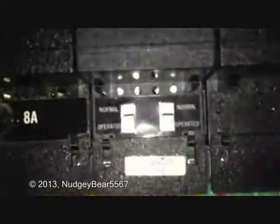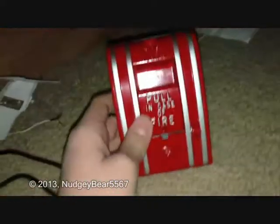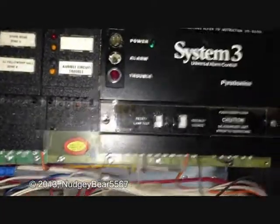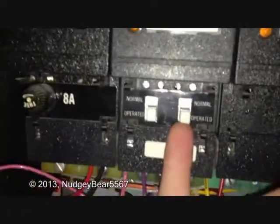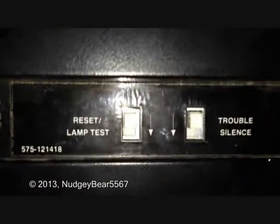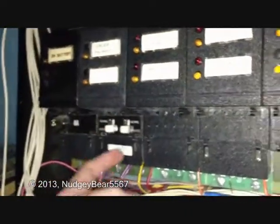Now the thing — you'd have to have the horns in the operated position. I'll just pull this thing. It got a new one — watch the video of unboxing. You'd pull the fire alarm, then the alarm signal will go to the panel. To silence the horns, you'd push these two switches up, then hit the reset switch. You'd push that down and then it would reset the panel, and then you'd have to put the things back in operated.